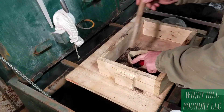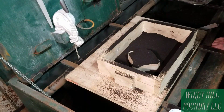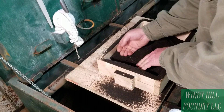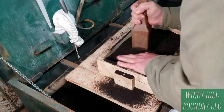I'm starting off with facing sand, which is a slight bit drier in content. And I use a small metal shroud to keep from wasting it. And here I'm backing it with regular sand and removing it.